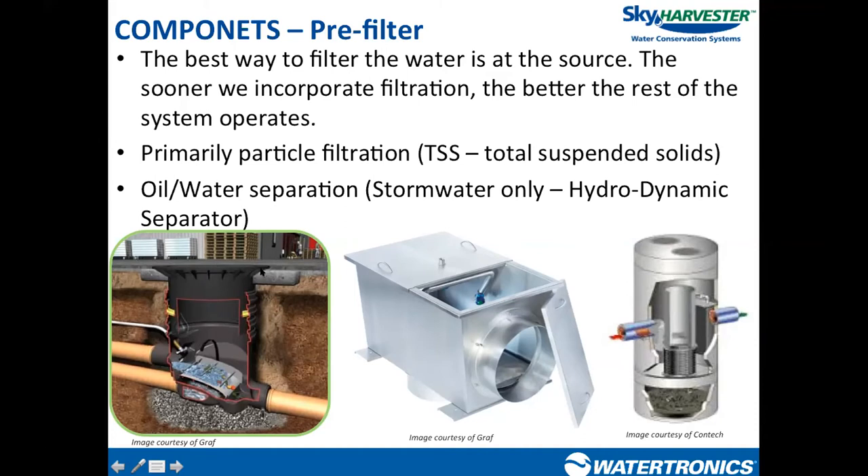All rainwater filters have three connections: one inlet and two outlets. One outlet carries clean filtered water to the storage tank; the other carries dirty water or overflow. These filters have two outlets because they're installed in drainage piping systems and you can never back up the drainage piping from a building. The goal is to evacuate water off the roof for safety and convey it away from the building to keep the foundation intact.